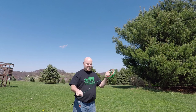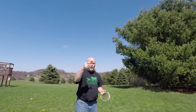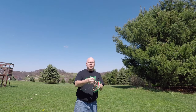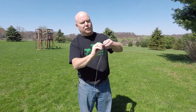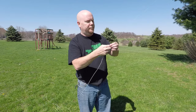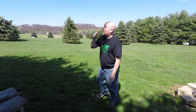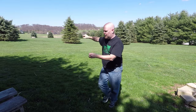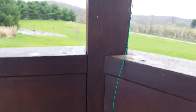Here is my random wire antenna — it is 84 feet of thermostat wire. I had to strip three pieces and solder them together to get 84 feet, but here it is. There's a 9-to-1 balun on the end; that's another video on how to make one of those, but trust me, it's easy. That gives me a coax connector off to the wire. I should have left myself a couple of extra inches on the end because I've got to fold it back and twist it up, effectively shortening the wire by two inches — but out of 84 feet, I don't think it matters. This half of the operation is a whole lot easier if you're not working with a pine tree. It feels pretty snug, so I'm just going to tie it off to this little table down here and call it a day. No substitute for height with an antenna, so I'm putting this thing up as far as I can. And here's the final antenna.